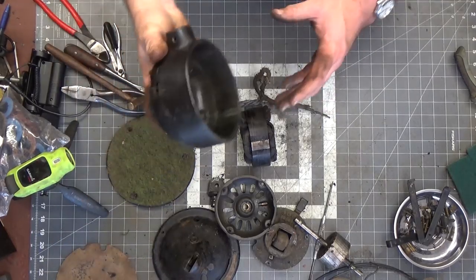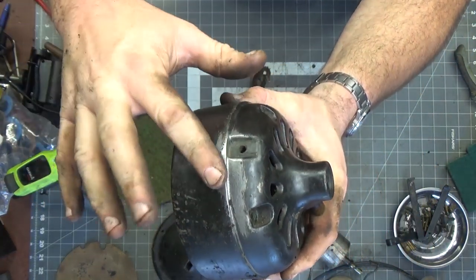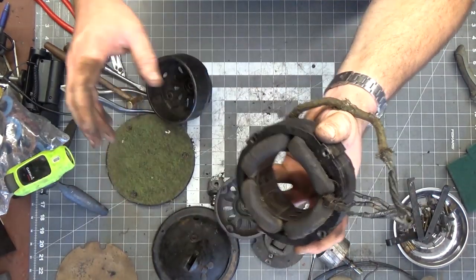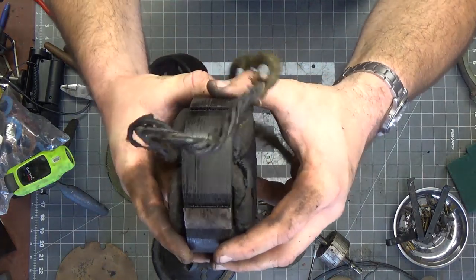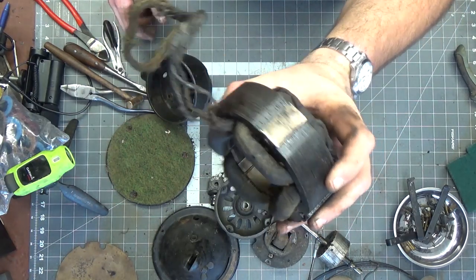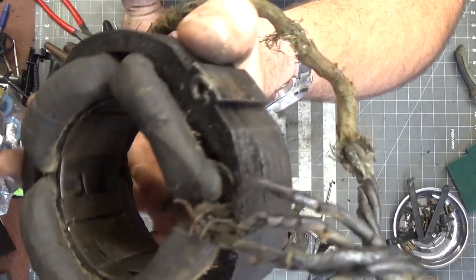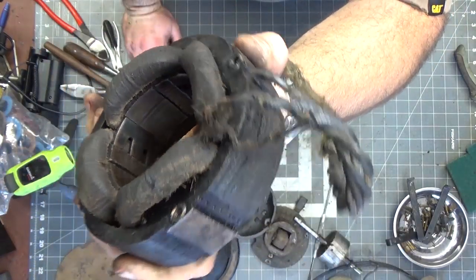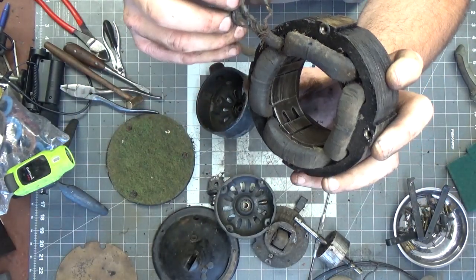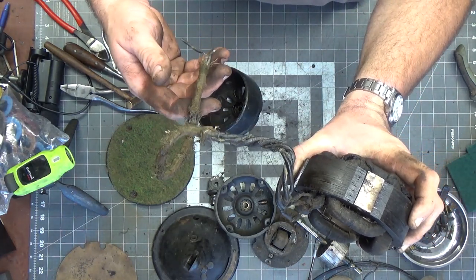I got the motor apart. This motor is one-sided — it's only got one face on it. I wire-wheeled it off and could see there was no seam on this side. I then very delicately used a brass hammer to start walking the field coil out of it. I needed to do this because this is going to need to be repainted, and I need to figure out the wiring — I've got four wires coming up here but only two were going into the speed controller.